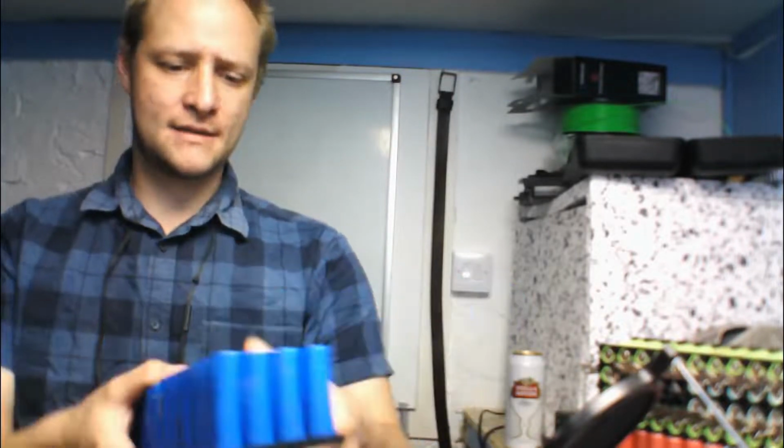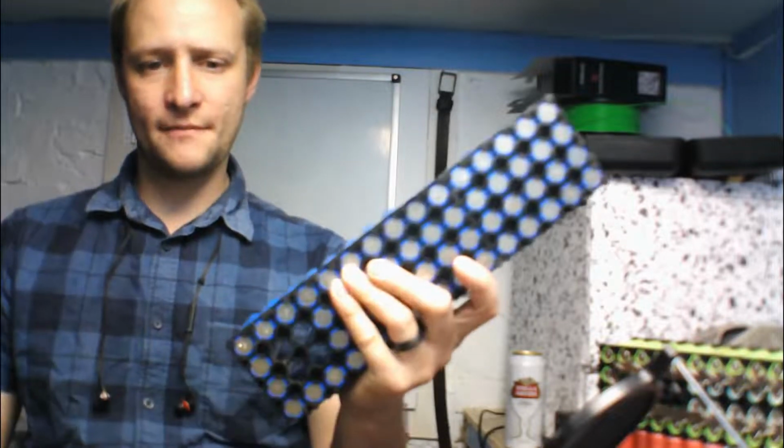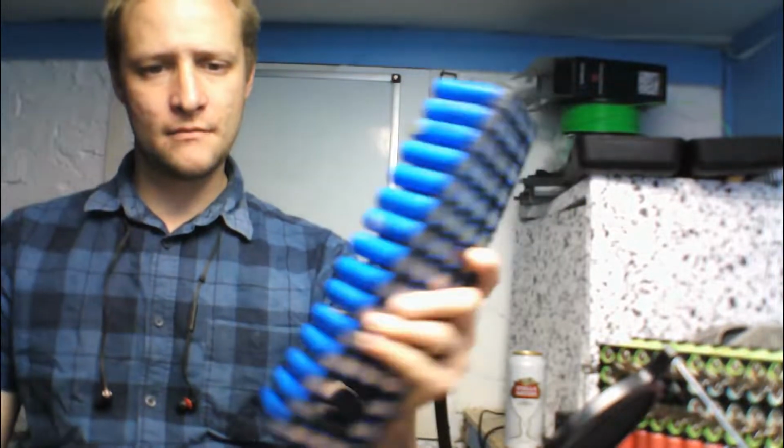I'm still engaged in the Powerwall business. I've started to do 60 cell packs now. I think 60 cells is quite convenient. It's not too heavy. We can get 60 cells and 120 amp hour. I've actually figured out I've got enough for 9 kilowatt hours now because I had, I won't say an accident, some got damp, so I binned them. I've gone for 60 cells.